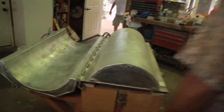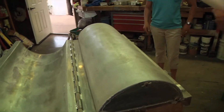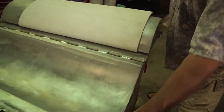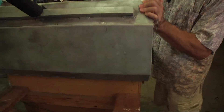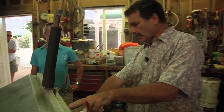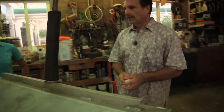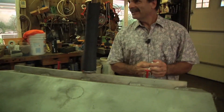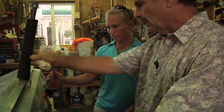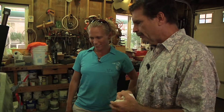What the tool does is you heat the plastic up, put it in flat, and it's like a waffle maker — and then you make your waffles. These are water-cooled so they keep the same temperature. The metal piece was done via CAD design, then taken to Precision Water Cutting in Lahaina, where they cut the pieces and welded it together.